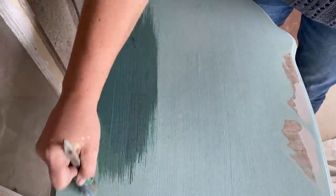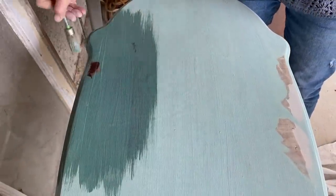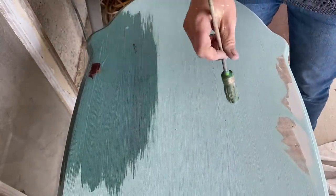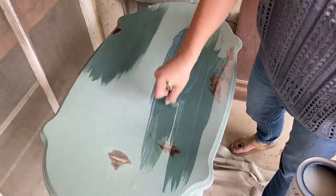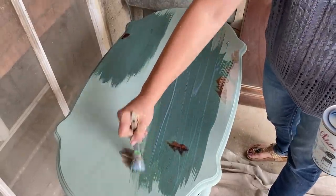I could use the white Salvation Solution but I don't want white primer showing on this piece — that's where the clear comes in handy. I'm putting the Salvation Solution on this one too because where we sanded it had a little bit of bleed-through. Zeb came back and sanded the high spots, so I'm probably going to do the whole thing — it has a strange faint bleed-through pattern that I feel like is going to come through later.